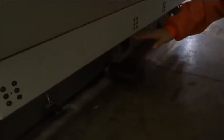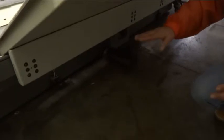And when you level the machine, guys, then you can put the chip conveyor to level against the machine sheet metal, so the water and chips would not go out there. Like any other machine, you level the chip conveyor up to the sheet metal. See the level there? To the machine here, and so everything is tight with the water, etc. So let's go in the back.